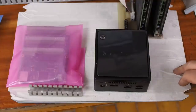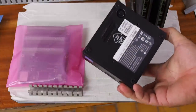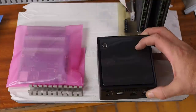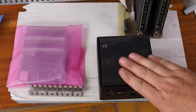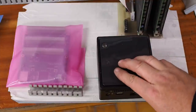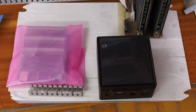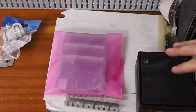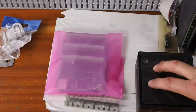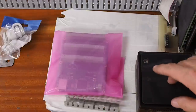So we've established we need a computer, our little Gigabyte GB-BSi3-1115G4 or something, that's going to be running Linux CNC. Now, a computer can't output muscle power to move a motor. So we're going to need some motor drivers, in this case, these stepper motor drivers. Now, we're going to need multiple things to happen at the same time. For example, turning the lead screw along the bed and turning the lead screw across the bed at the same time to turn our taper.